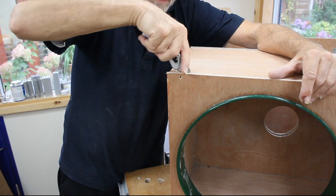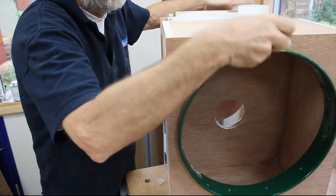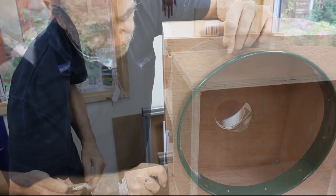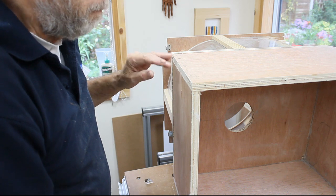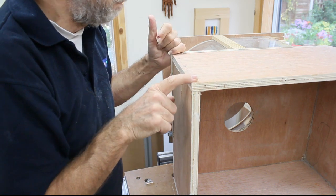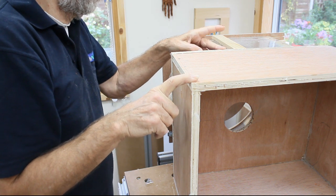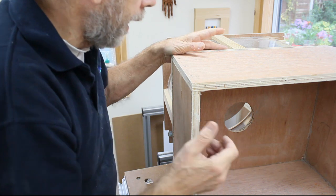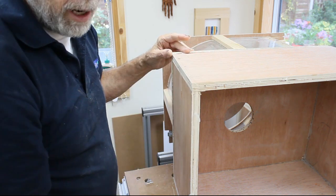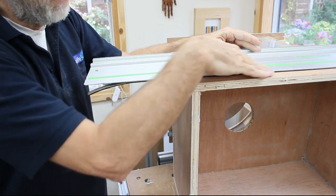Fortunately I've just realised it wasn't glued — it's mastic that I put on to seal the enclosure, so it's not quite the problem I thought it might be. It's a matter of breaking the seal on the mastic on the top. There are a couple of options for cutting the top off. Ideally I'd put the box itself on the circular saw and run it through against the fence to take 25mm off. But I've also got the cyclone attached by double-sided foam tape to seal it from air leakage, and that's quite a problem to undo. So I think I'll just get the track saw, pop the blade to 25mm depth, and go around the four sides. It's fairly stable like that, so we'll do it that way.